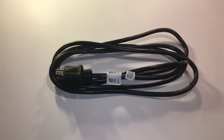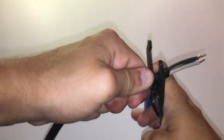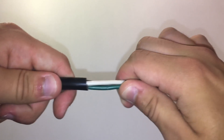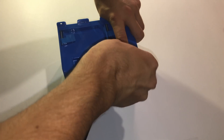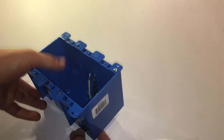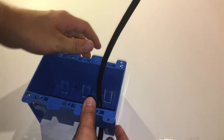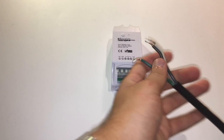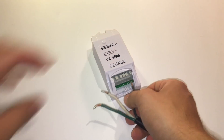Grab the 14 gauge power cable and strip off some of the black insulation. Use the blades of the wire strippers to score the black insulation, twist it free, and remove it from the cable. Then strip the leads to expose the copper. Next, take the electrical enclosure and stick the power cable through one of the holes — use a screwdriver to push the flap up slightly to make it easier. Pull the cable so there's about 10 inches inside the enclosure to make connecting the Sonoff easier. Grab the power cable and connect the black wire (the live wire) into the input L port on the Sonoff.